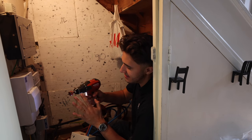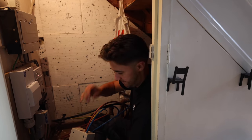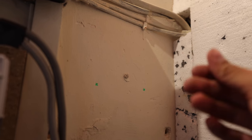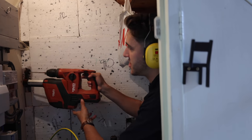It's the little things in life - having your Hilti and your drill match your hole saw. Nice. You see these rawplugs here - I'm not sure, I probably shouldn't be touching them especially not on camera, but I have a feeling they could well be asbestos. What they used to do is have it inside a little tin, you'd mush it up with your spit, push it into the wall and screw a screw into it - that was seriously how rawplugs used to be. Look it up: old asbestos rawplugs.